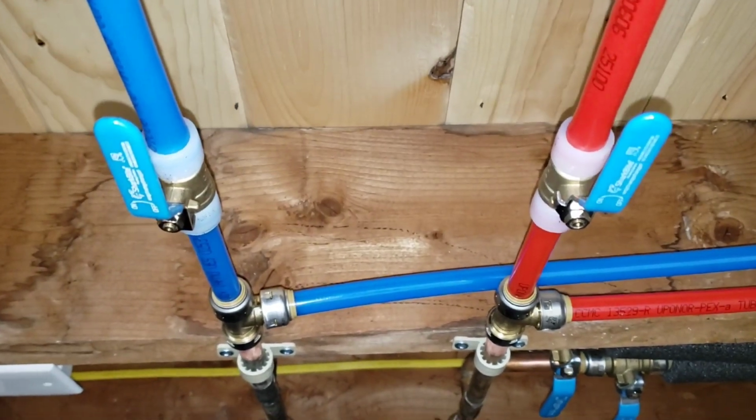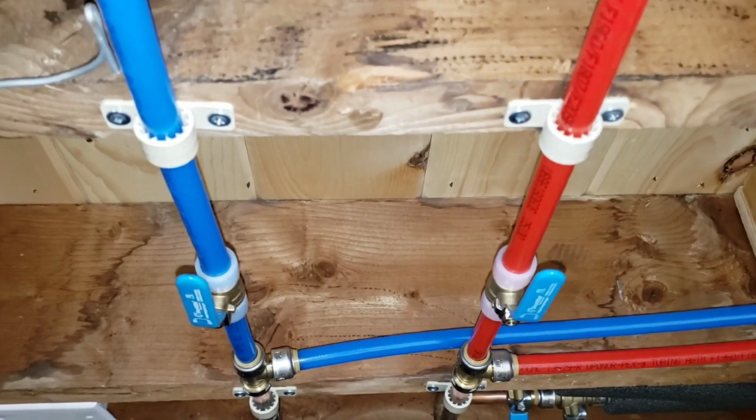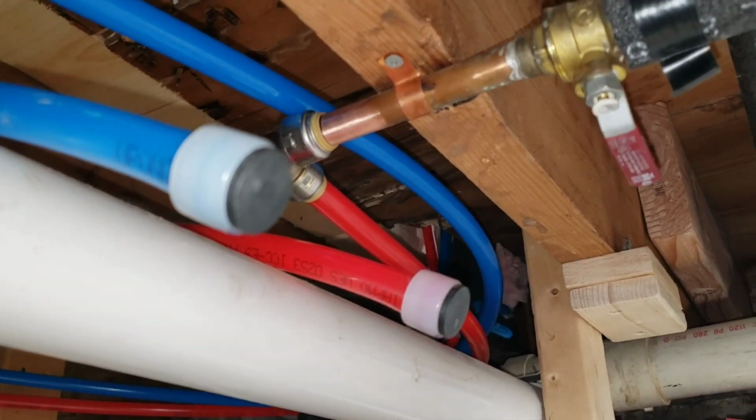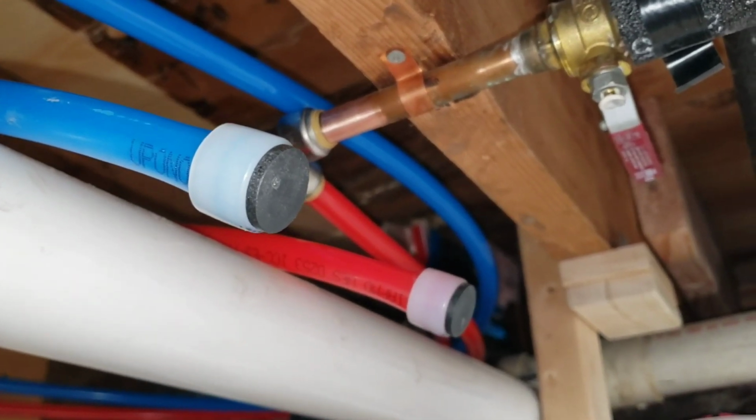These are the shut-off valves for the first floor bathroom vanity that I'm getting this arranged for. And what I did was I left 2 stubby ends because I still have to put it up through the wall. At first I want to put the drain pipe in, and then I'll decide how we need to route those.